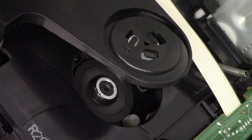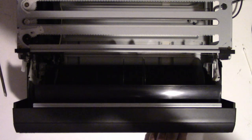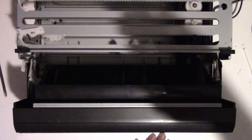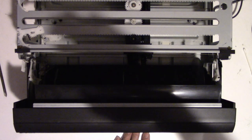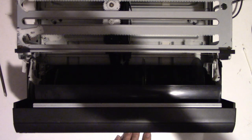Let's go ahead and reassemble it now. The recording lights are off because this unit uses a visible red LED and a photodiode to detect the presence of a disc so it can figure out what slot it's in — it just sequentially counts the slots. It has no position encoding or resolving equipment whatsoever. I have three discs in it, and I'll ask it to play. It goes across, comes back — and it found disc 64, then disc 51, no problem.